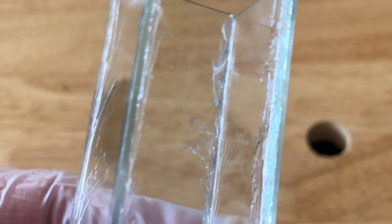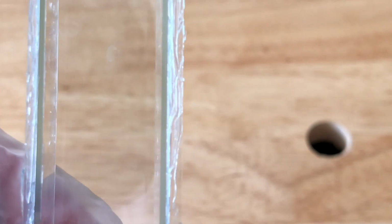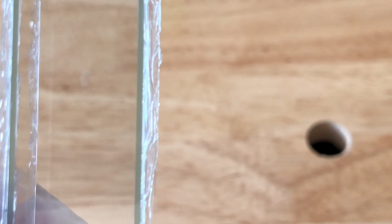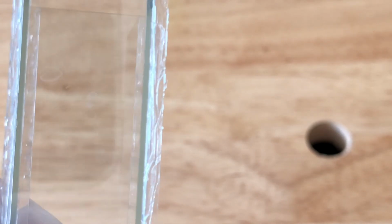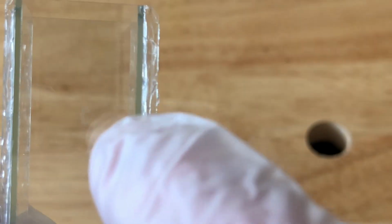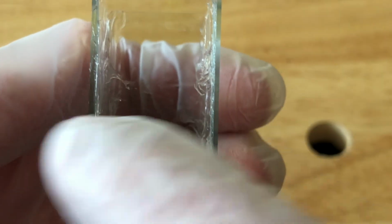What's going to happen when I focus the nitrogen laser beam on that glass right there, it's going to form a tiny line on the inside of there, a line of bright laser light, because all the laser light is going to be absorbed right inside the surface of that glass. And the amplification is going to take place along there. So you have to have clearance right here so the beam right inside that wall can pass out either side of it, where that line is focused. Because the line is going to be focused along the length here.